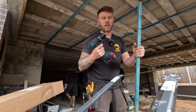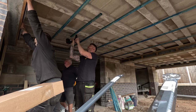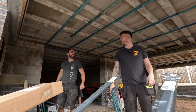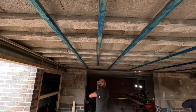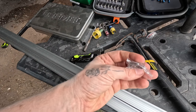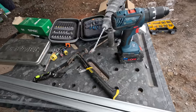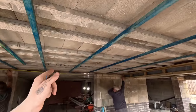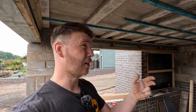Right, these are concrete screws with the Torx bit - always one up, hold it in place, and help me drill the next one because Adam's too busy taking pictures of his van. Let me get some little screws too - it should be right, it'll support on the next one. Right, we've got our first piece up. Mike, shift your ass to the right. There we go, laser's on. What we're going to have to do now - it does come with these brackets that you can just screw to and clip up - but we're going to put some holes in this. We're going to use a little Bosch bit, one of the blue bits. Four mil in the combi - we're probably going to do four fixings down that, making sure that this end is for our cable, running the cables around that side.